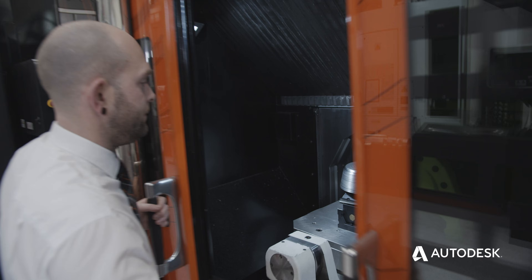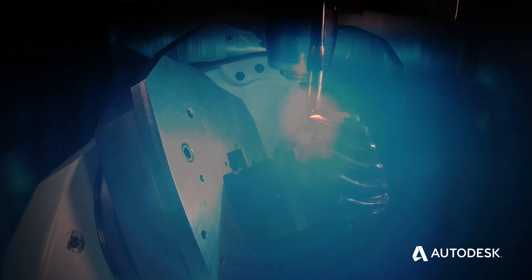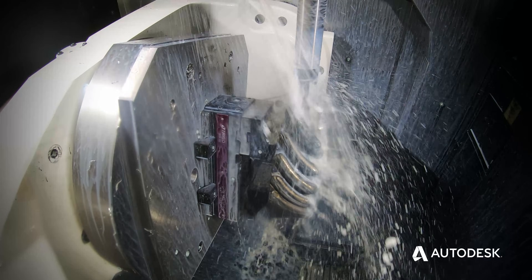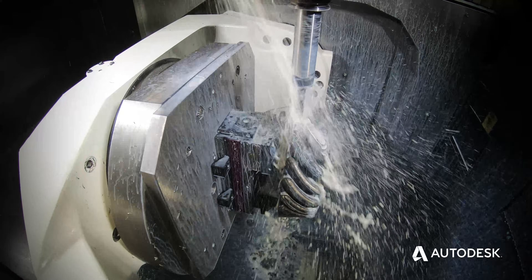The block itself, which is the hub, we're using Inconel 718, and to build the blisks themselves we're using Inconel 625. Using these materials can be quite challenging when you're trying to machine things — you have to run things quite slowly with small depths of cut. This costs a lot of money in machine time as well as tooling. The great thing about this technology is building to near net shape, so you have a lot less material to be cutting.